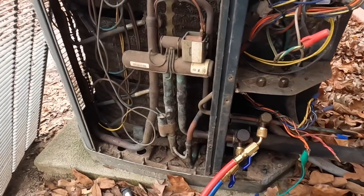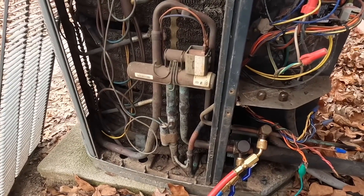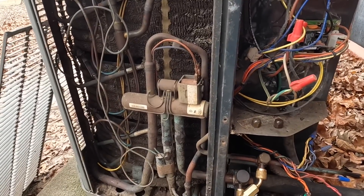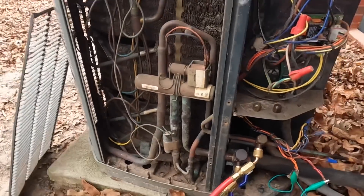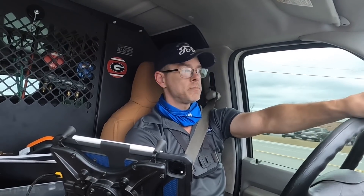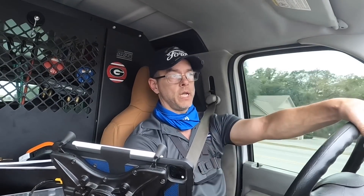This is the other unit — I was just checking on it. Like I said, they just installed an air handler yesterday. Once again, a 20-year-old R22 12-SEER Trane. For the upstairs, that was a two-and-a-half ton — we installed a three-ton air handler that had a piston in it. I left the 410 piston in it and we converted it to MO99.